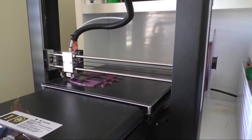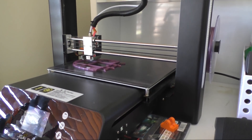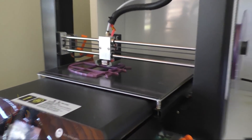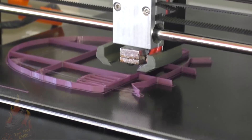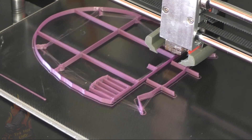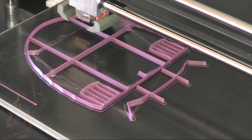Having absorbed all their knowledge, I spent about a week checking settings and experimenting, seeing what would work best for my printers. They recommended printing at high temperatures around 230 degrees, but I found that was too hot — it made the parts too brittle. Their reasoning was that it was for layer adhesion. I printed at 210 degrees and it turned out fine.